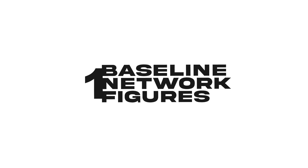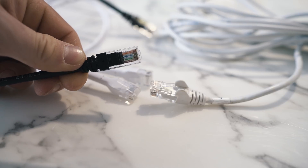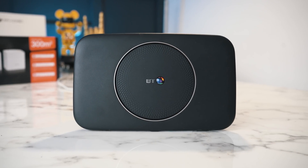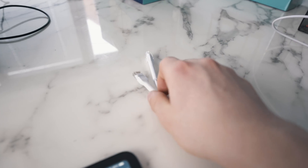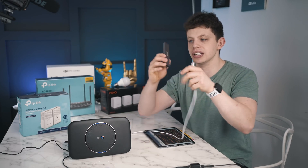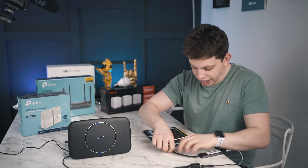Welcome to my kitchen. I've got some free tips for you guys to do at home to hopefully improve your networking experience, but if you're still having issues, we're also going to check out some bits of kit that you can buy to improve the experience furthermore. Before we start any of this, it's really important that we get some baseline figures. To do that, we need to be hardwired to our network. As you can see, this is a typical UK setup — I've got the internet coming in here, going straight into this BT router, giving off Wi-Fi. What I'm going to do is take this patch cable, plug it into the back of the router, and then take this Ethernet to USB-C adapter and plug it straight into my iPad.